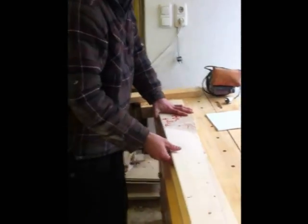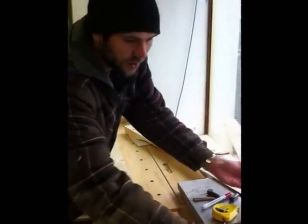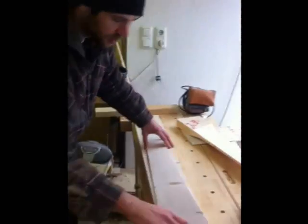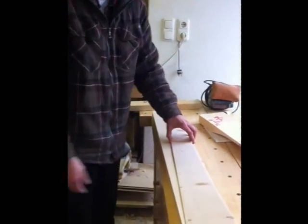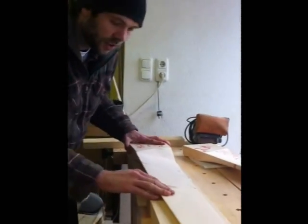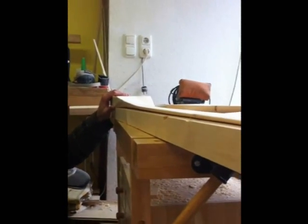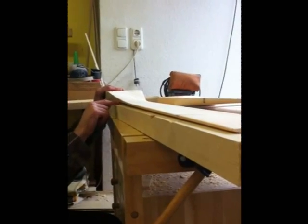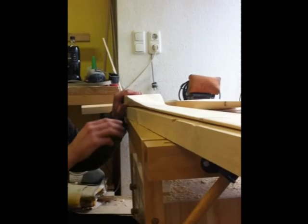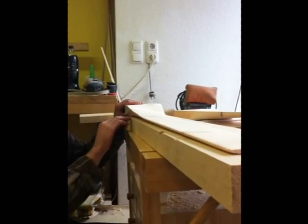Using my way, it is a little bit different, because I move all the stations completely down to the bottom of the lee side. Maybe this way it can be seen more easily. What I do is place the highest point of the airfoil at the 1/3 station on the bottom of the blade. So we take the bottom of the wood that we use to carve the blade as the reference line.